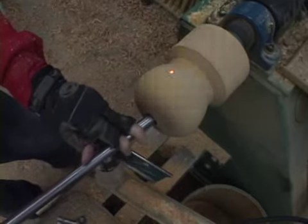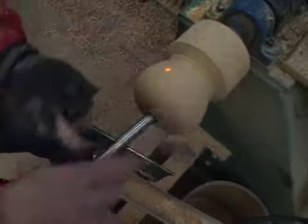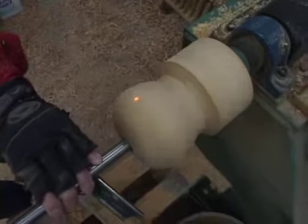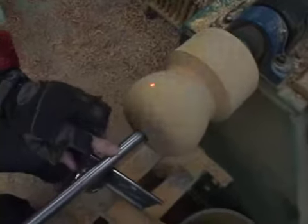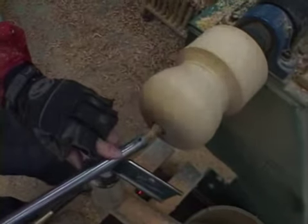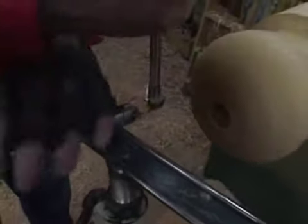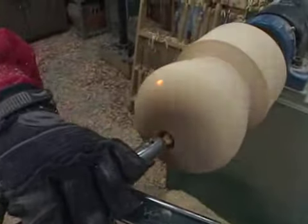And if we pretend we're getting down into a very long, tall vessel, I need to get into a confined space. So I need to have a straight swivel holder to do that with. I can do a little bit of bent cutter application with this because the swivel has an infinite range of moving it around. I can swivel it around here and get it in and out of the small hole still and cut under the shoulder.